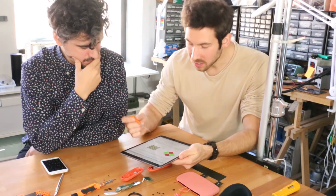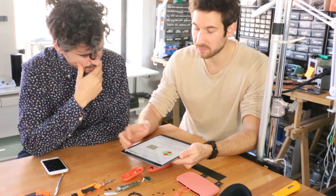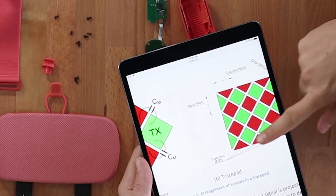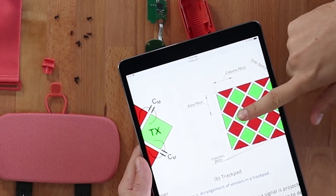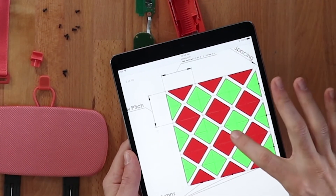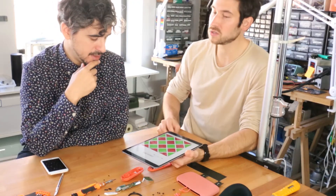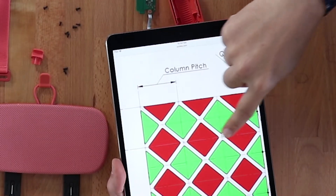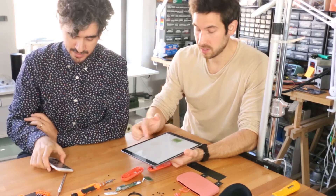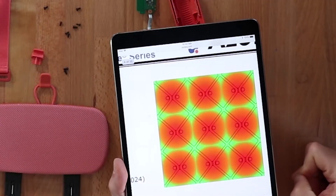How do these work? Each capacitive sensor consists of a transmit conductor and a receive conductor in close proximity. I can tell you're there because all of these are lit up — I'm receiving signal from all of them. Basically your finger is bridging a transmit or receive conductor at every moment, and by measuring signal strength as you move around, you get really highly precise position tracking — which may be explained here in this diagram.